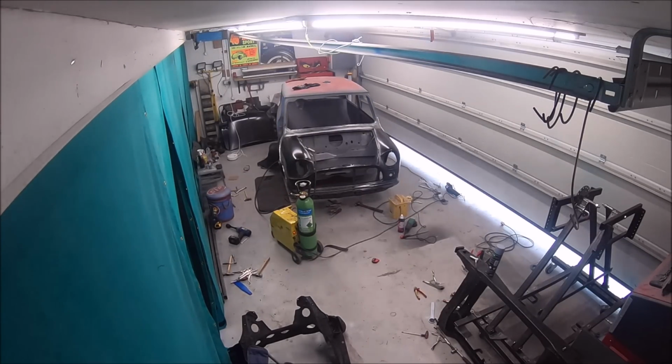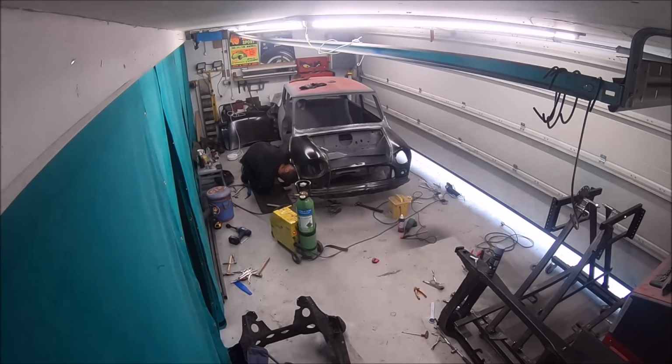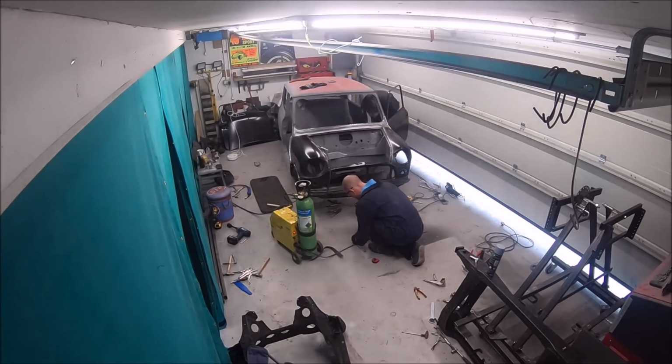I don't believe in repairing it unless it's only slightly cracked. The problem is it's cracked, so the metal will be fatigued. So you can weld it up, but then all you end up doing is making part of that panel stronger than another part. So if you weld repair a structural panel or part like that, all that generally happens is it just cracks in a different place.